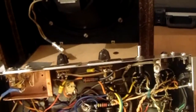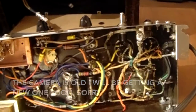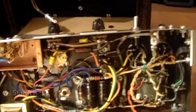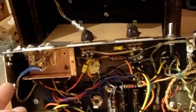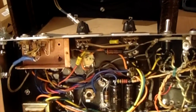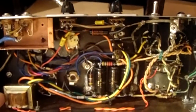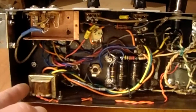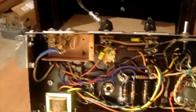I used a lot of the signal generator's components — a lot of original wiring, a lot of old resistors, and the values were still good. I bought some pretty decent capacitors; I changed the value of the first one to 16 microfarads and left the two additional ones at 10. I used a 5691 preamp tube, which draws a lot of current, and the transformer wasn't putting out enough in the six-volt range.